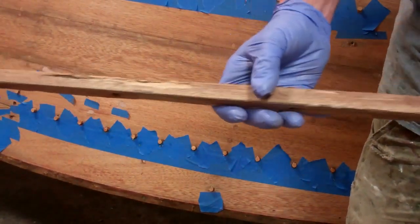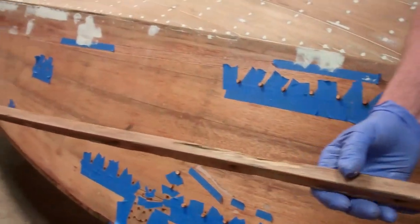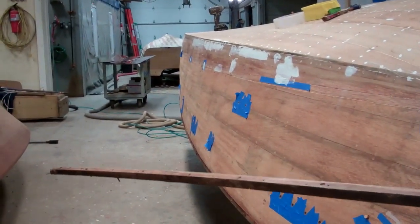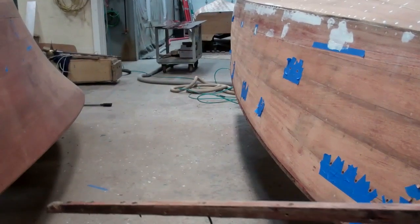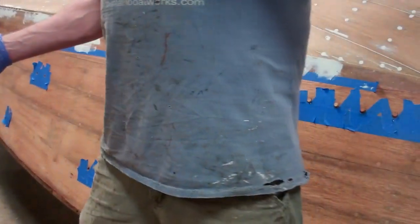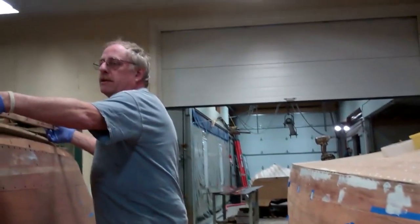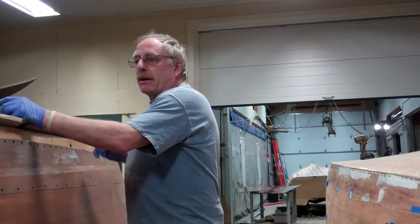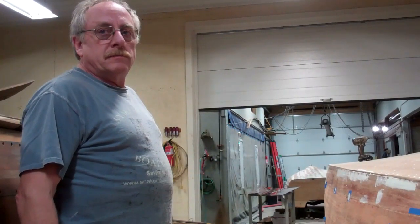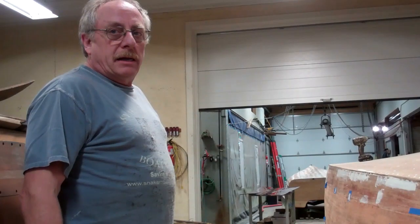This one needs a smaller Dutchman than the other part. Is the aft end okay, or is it just the starboard side that's bad? It's the other side where the aft end is real bad. But this one here behind it was in pretty good shape. The other one, unfortunately, had a Dutchman done previously in the back corner. That's why we had to take them off — it needs some work behind it. It was rotted behind it. And actually the rail itself was rotted — the last six inches or so was badly rotted.